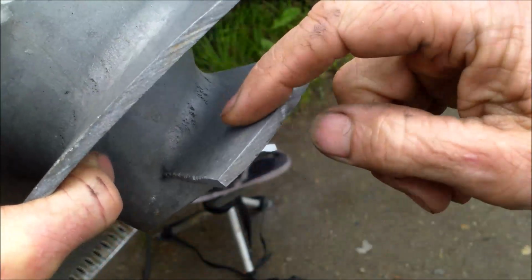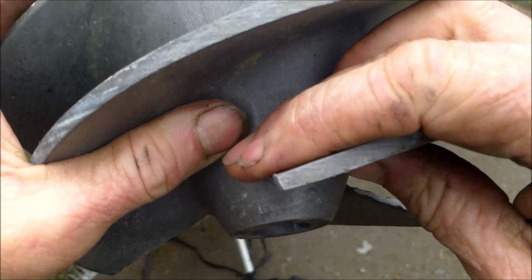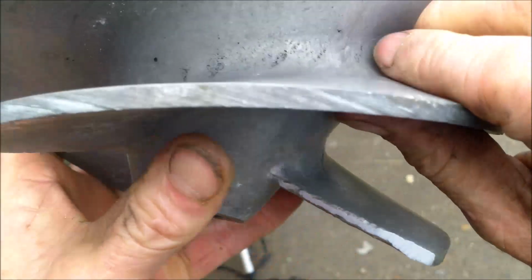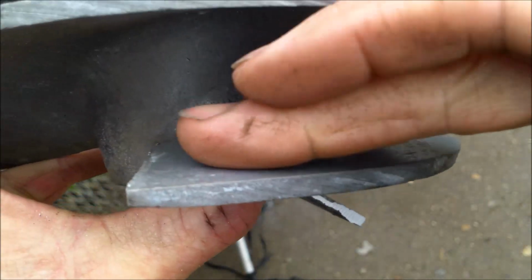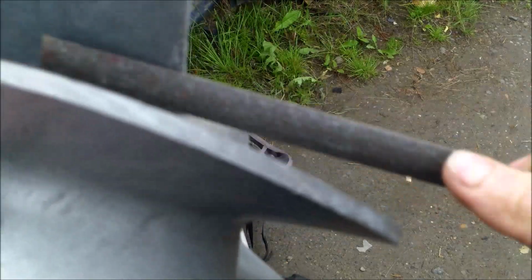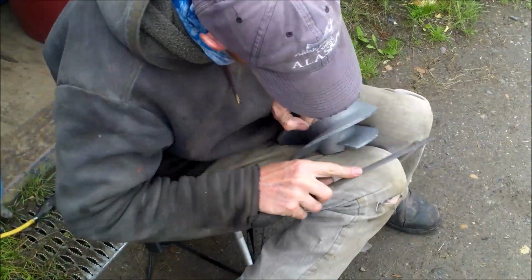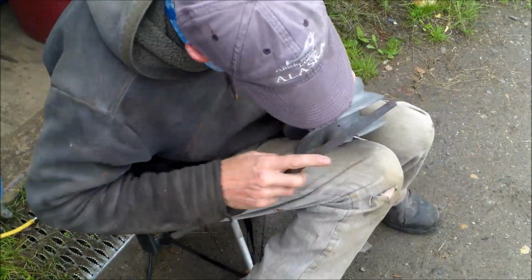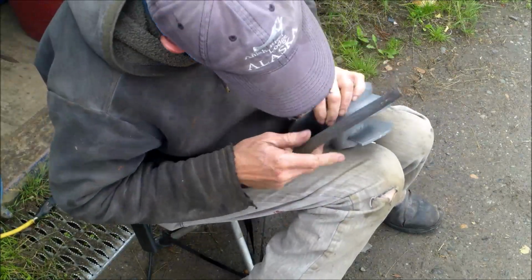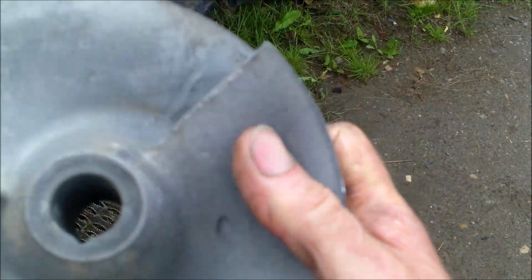Now I flip it and I will take the burr out of the back with the file. But just to take the burr out, no sharpening, nothing, just this burr. Okay, on every one you have to take that out with the file, well flattened. Just a small touch on the back to take the burr out. Now this is straight, we have no burr on the back.